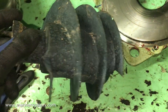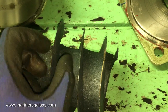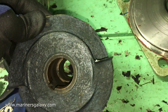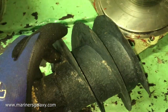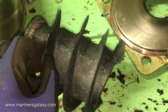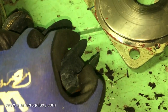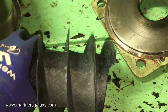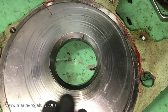The rotor material has gone very thin — it's not making proper clearances with the casing. We will have to examine it carefully. It looks damaged on the edges as well, and the dimensions have reduced considerably. There is erosion of the material. Now this is the end plate, and it shows deep grooving marks from wear, because this pump rotates and must have been touching the casing.